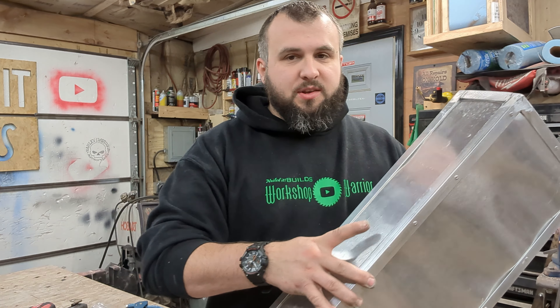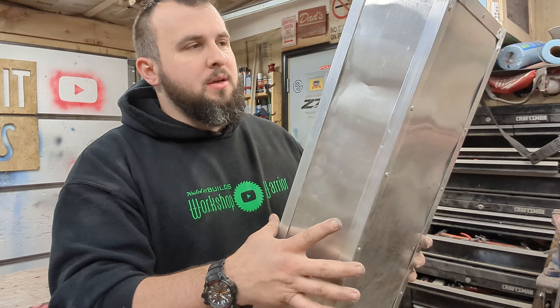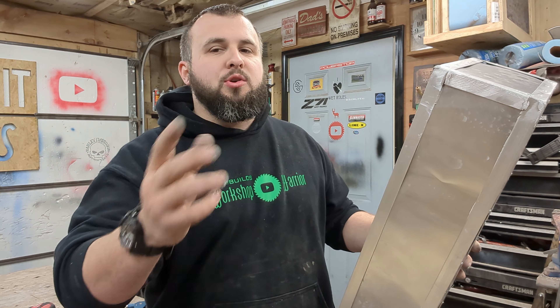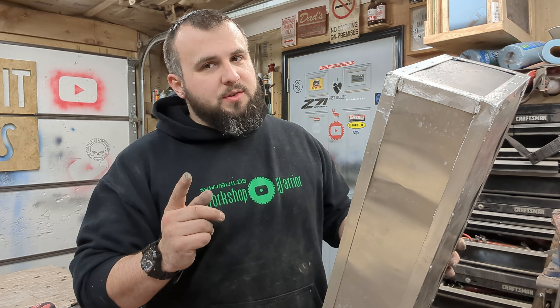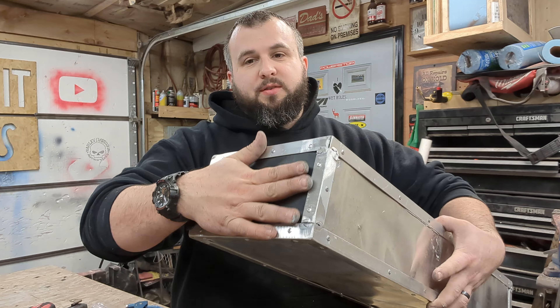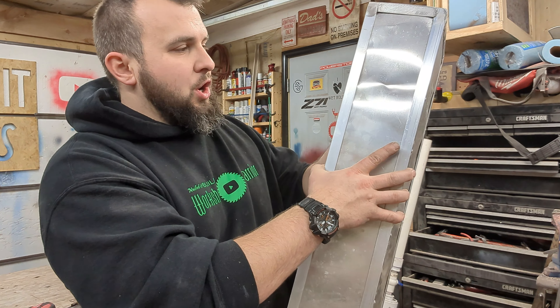On this other side I'm trying something different — I'm allowing the silicone to dry first before riveting, hoping that will hold it a little better and minimize the distortion. Right now it is a box like it's supposed to be. If you were building one of these, I'd keep the aluminum frame — it's a good idea and seems very strong. If you can't weld aluminum, just use L brackets and bolt them in. And honestly, if I wasn't so financially invested in the aluminum, I'd use big tote lids for the skin — it's strong, not going to have those ripples, and still really light.